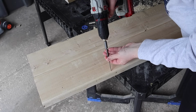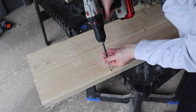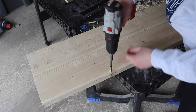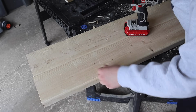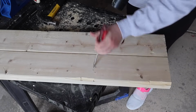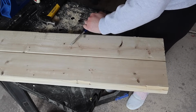Then once my seat to my bench was put together, I used a screw in my drill and went at an angle on the edge. This is going to help me really start to distress this to look like the inspiration. I saw somebody on TikTok do this and I was like, this is genius. I'm going to try this. And it's basically like using a little wedge to make your wood look reclaimed. Pine is a really soft wood, and so this is easy to do.